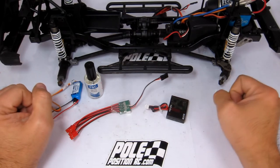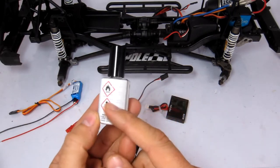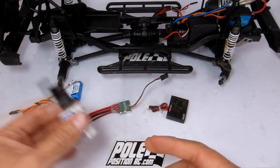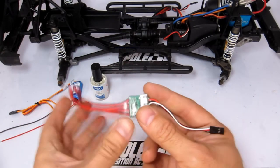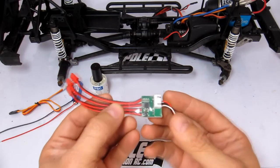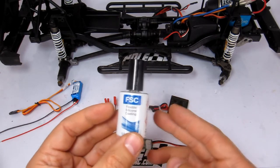It's very quick and simple. Basically the secret is this stuff here — flexible silicone coating. This is really handy stuff. You can get it online on eBay or probably at an electronics store near you. What this does is put a clear coating on all of your electronics so that water can't get in. This is basically the same sort of stuff used by manufacturers when they waterproof things.